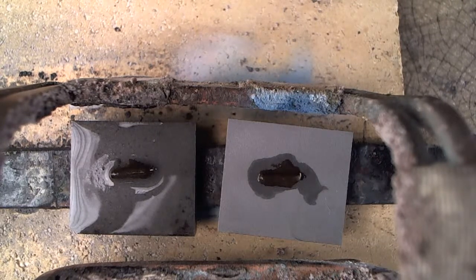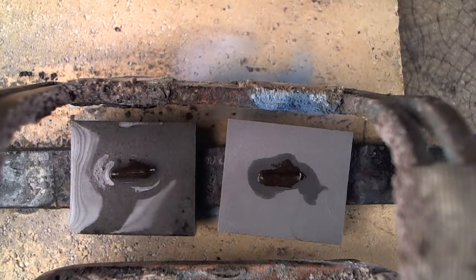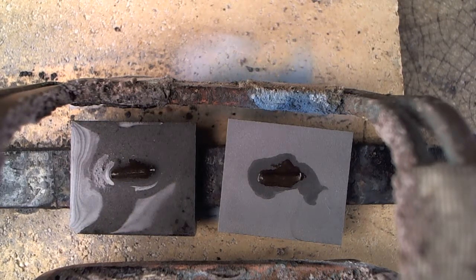Top and bottom, you can see the tubes from the induction coil. The bar running across the middle is just a mild steel bar. We use that because it heats up a lot faster than the carbide does, and because we want the heat coming through the carbide into the braze alloy. There's a piece of wire with a little bit of black flux in the middle, and the water on the right and the solvent on the left haven't completely dried.